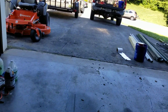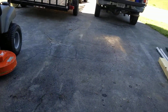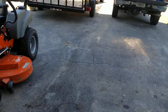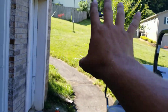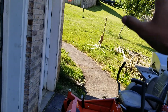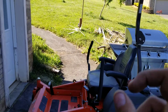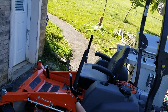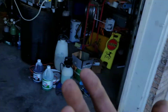That way I can take them up individually, knowing they're producing proper electricity. We'll have a plus or minus 3 to 5 percent of rating when I point it perfectly at the sun. Once all the panels are on the roof, I can start wiring them all up. I haven't got my crimpers yet — I used HVAC crimpers, which is not the best for solar MC4 connectors. So I went ahead and ordered a solar MC4 crimper, which should be here on the 17th from eBay — it's an affordable crimper, which is awesome.